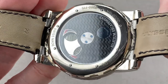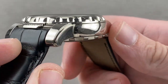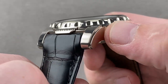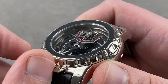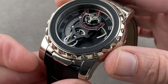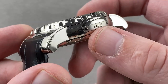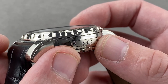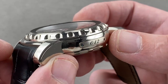The watch is remarkable. First, it is remarkably contoured — incredibly contoured, with a lot of nuance. There's the knurling of the bezel, the knurling of the case back, two different knurling patterns — take note. There's a fluting of the lugs, which are nicely tapered. There is the decoupling system down at six o'clock that allows you to unlock the bezel setting mechanism, and the bezel itself is one and the same as the setting mechanism. There are no crowns on a traditional Freak. You can see it does pay tribute to tradition — but distant tradition — with a set of fired screws fixing an individually engraved plate. That is the number of the watch in the series of Freak Diavolo models, and this is a reference to Ulysse Nardin marine chronometers of the 19th and early 20th century that would have had individual numbering plates.